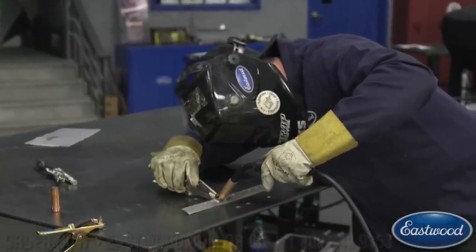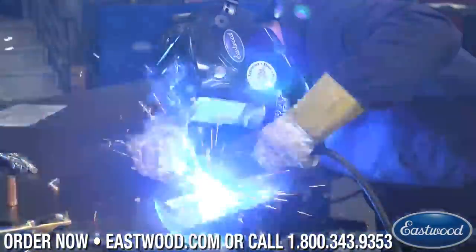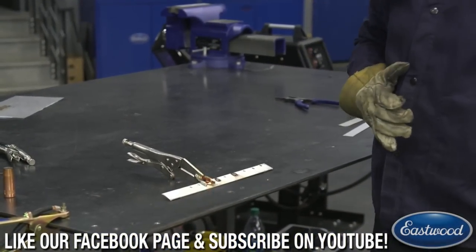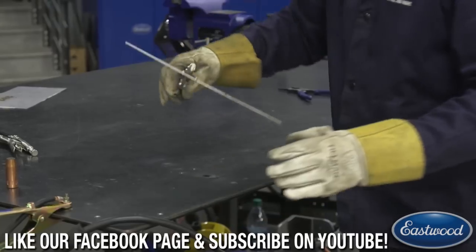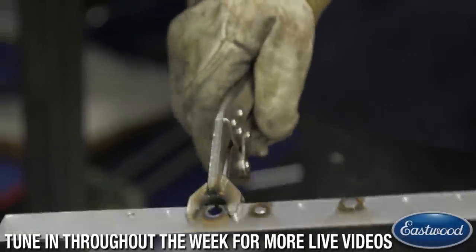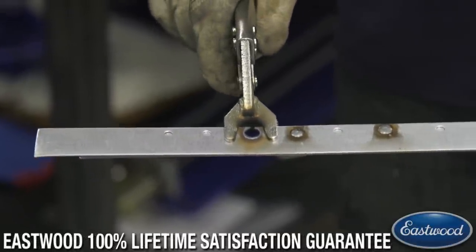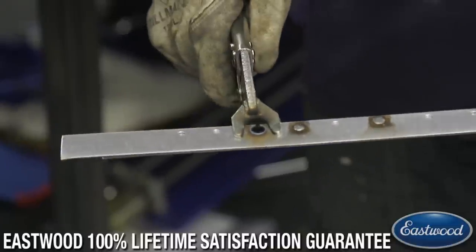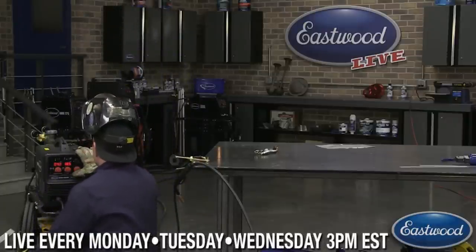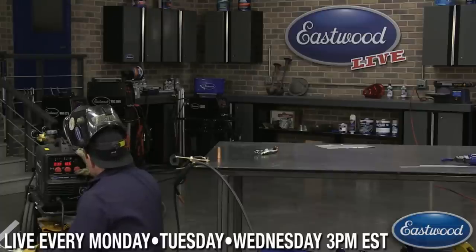Let's check and see what we got here. I'm just going to hold the trigger down and it'll stop automatically. Now you can hear — way too long there. It's just going to burn away at that time setting. Same voltage on the machine, same power — it's just that with the spot timer, holding it on much longer just burned it away. So that's far too long. There's really not much reason to have it that far up unless you're doing an actual plug weld where you're filling a hole.